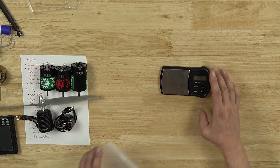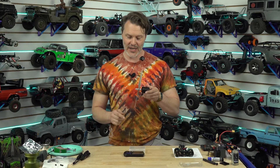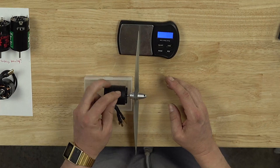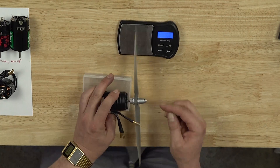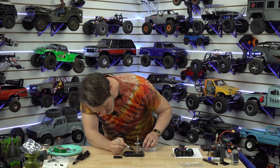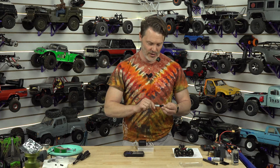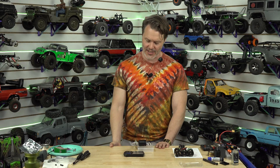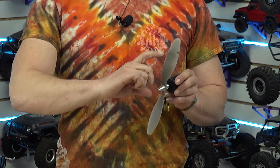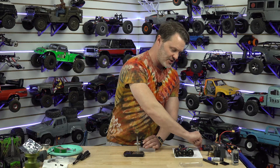I've got this quick and dirty setup — an arbitrary length arm. I'm going to rotate the motors so they press on this scale, making sure we press on the same point every time. As long as our motors are the same diameter, they'll press at the same angle from the same height. I'll mark the point so our lever arm distance stays consistent, because lever arm distance will change our results. We could figure this out in gram-centimeters or ounce-inches, but all testing is done with the same equipment so it's an arbitrary number for today.